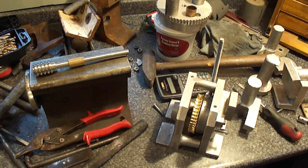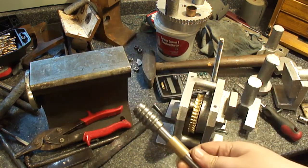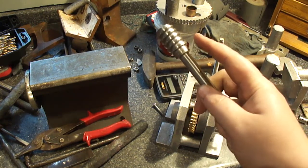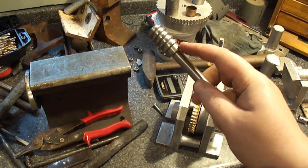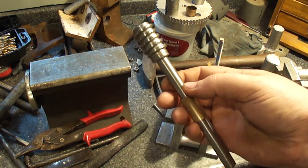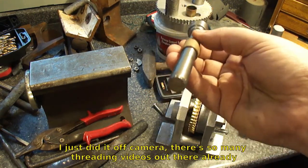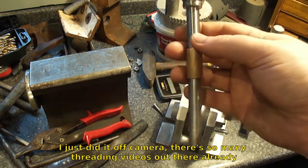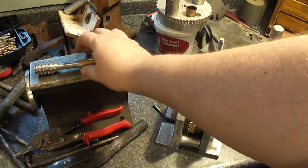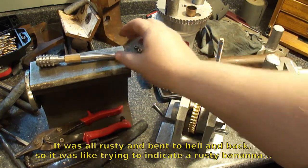Hello, I'm out here just messing around. You're supposed to take this worm gear, just buy it and pin it to the shaft so it doesn't turn, with a roll pin. But I figured since I'm gonna be making the worm, might as well make the worm and shaft all in one piece. I don't have any chance of it spinning on me and I don't have to buy mild steel stock. I just made it out of some junk I had lying around. I think it turned out quite nice.